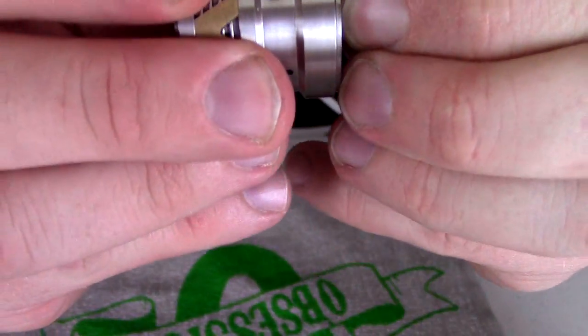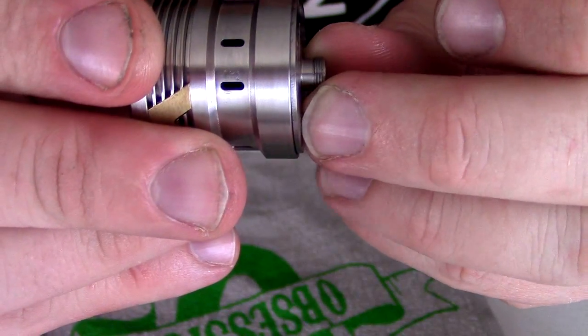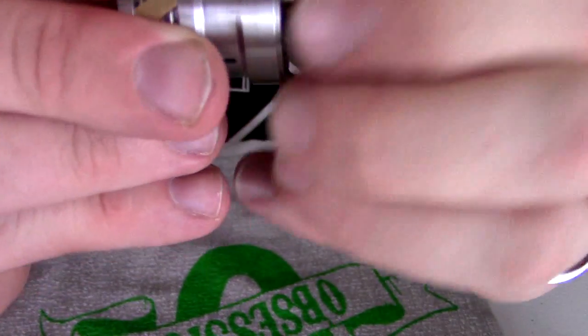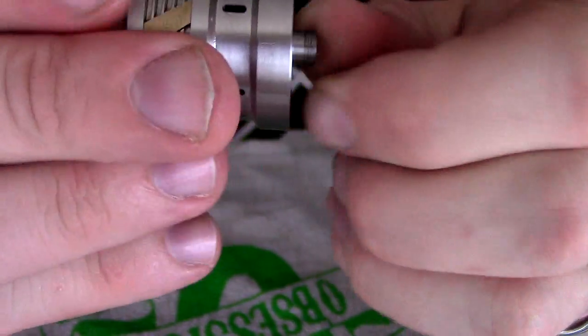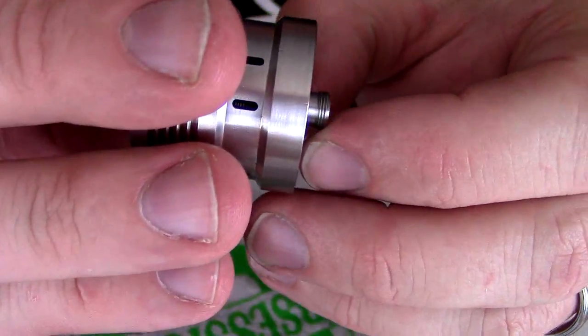See, I put it on and it went the first time. Let's see, I go a little bit off. See that little gap there at the bottom? Now that means it's not aligned. Now if I adjust it just enough and I line up those dowels, see, now it goes all the way up in, okay? And it's fully seated down, okay?